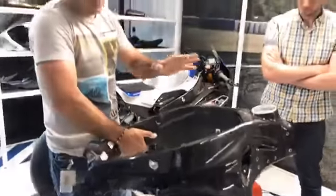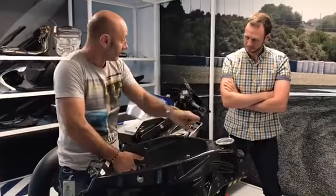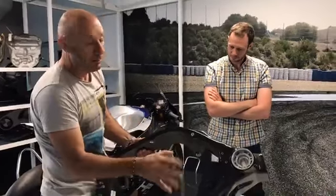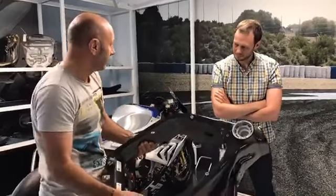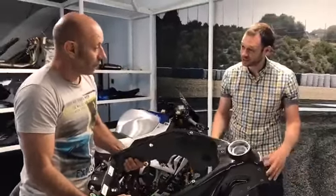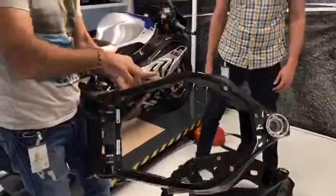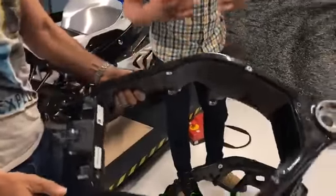This is the big advantage, because with a frame you have to work with two different kinds of stiffness. In terms of braking you need a lot of stability, but when you go into a corner you need flexibility in part of the corner. With aluminium, this is much more difficult. So what's the weight difference? It's four kilos — this weighs 7.8 kilos and this weighs 11.8. Unbelievable difference. And when you hear it, you really hear how light and how stiff the frame is.